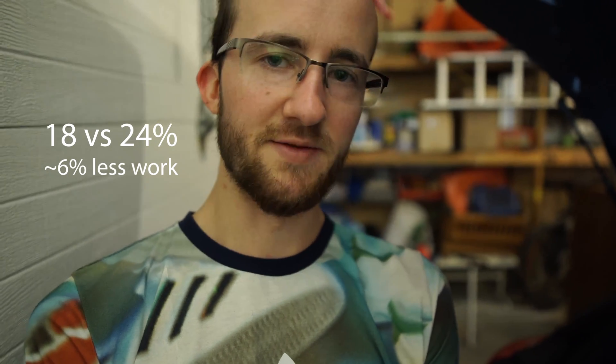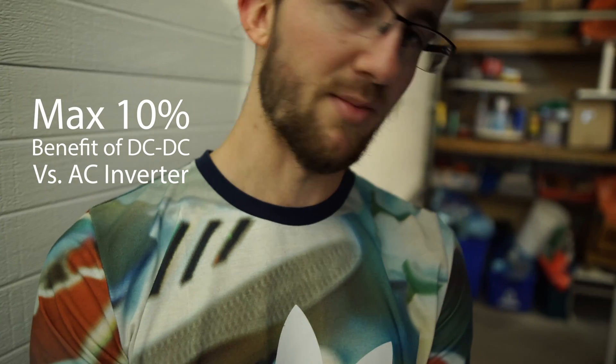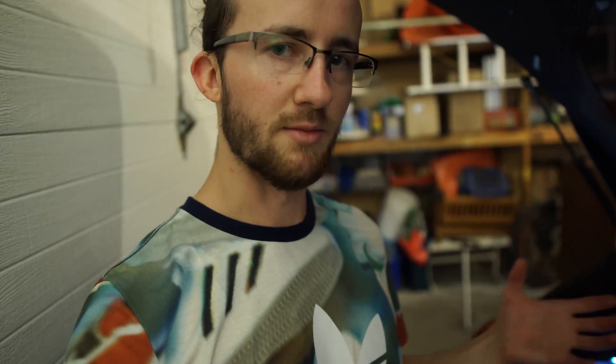All finished. I charged up the yellowtop overnight with the NOCO and then ran the second pair of batteries with the AC inverter setup. The voltage drop difference before and after charging was just 0.03 volts, which is about 4% of this battery's capacity — a pittance. The difference in efficiency is not nearly as large as I thought it might be. To be fair, I did give the AC charger an advantage by giving it a higher-charge battery to start, so the real efficiency difference is probably a little bit higher than 4% but not by much. You do lose a decent amount of energy converting from DC to AC and back to DC again, but I feel like I'm losing nearly as much energy to heat through these little DC car charging chips.